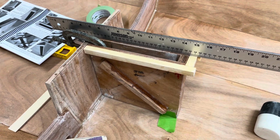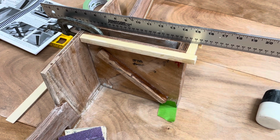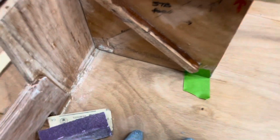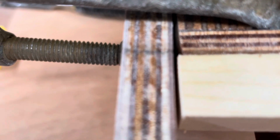So the manual and me, we both keep talking about the importance of dry fitting the pieces before you actually get the glue mixed up. And I can tell you, the dry fit is really important. Here's the Daggerboard case. And I don't know whether you can see it, but here at the bottom, it is right on that reference mark, the bottom port side. It's right on the reference mark here on the main bulkhead. It's right on the reference mark down here along the center line of the leading edge.